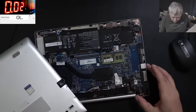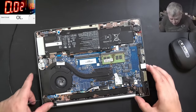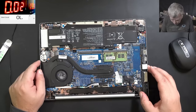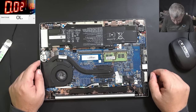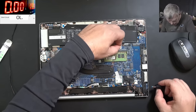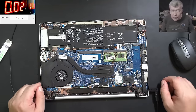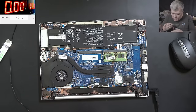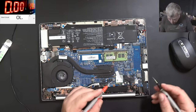The laptop is open. What's interesting is the battery is not charging, which means the EC chip is not really working. We do have a BIOS chip here. Motherboard looks like new. Let's unplug the battery and the BIOS battery, plug the charger - it's doing exactly the same thing. Let's check the coils before we start.